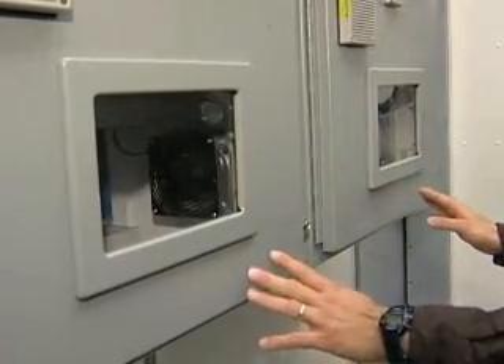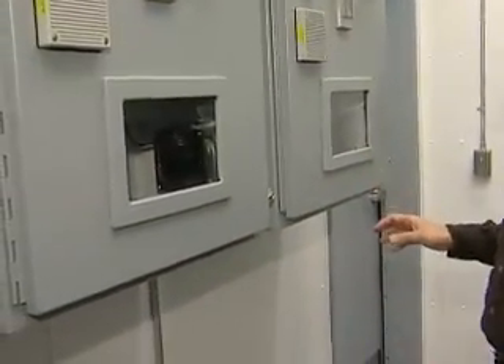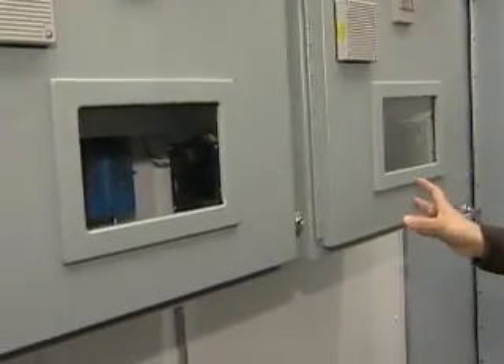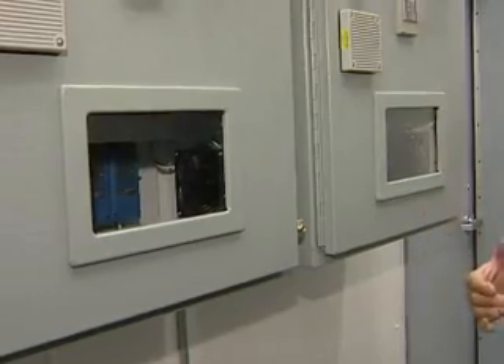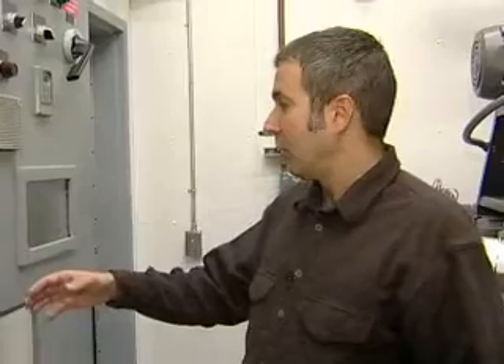One other thing to note: when we have a two-radiator system, we set the setpoints about five to ten degrees apart. In this case, the first radiator is set to operate at 175 degrees, so it comes on first, and then the second radiator at 180 degrees. In times of low load, it's very common to see only one radiator running. If load increases on a hot summer day, the second radiator may come on. This is called a lead-lag function — one radiator takes the lead and runs first, and when it can't meet the cooling requirements, the second radiator comes on.